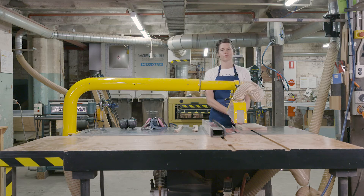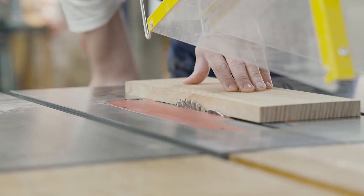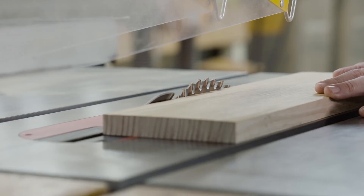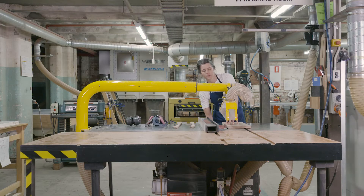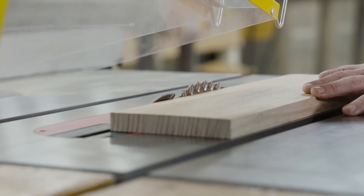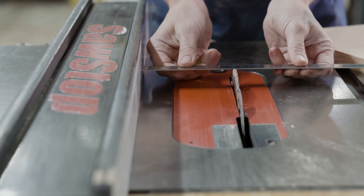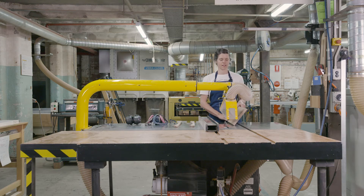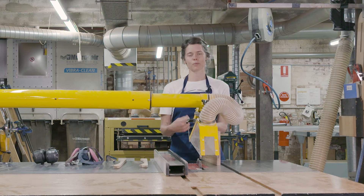We're going to cover some of the steps you'll need to go through before your rip cut. When adjusting the blade for height, put the piece of timber up next to the blade — you don't want any more of the blade exposed than is necessary. Drop the height of the blade down using the lever on the right and line up the gullet of the blade with the top of the timber. Ideally, the gullet will be just a little bit higher than the height of the timber. Use the guide to set an approximate width for the fence — overestimate slightly, then double-check with your own measuring device to make sure it's accurate and lock it in place. Keep in mind that the more material you're removing, the more blade is exposed, and the more dangerous the cut is.